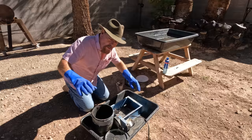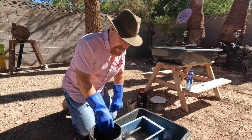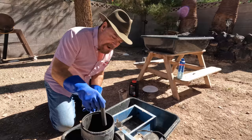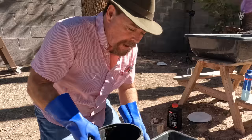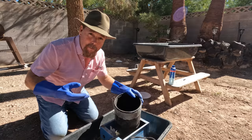Right now I'm going to show you how to set up that rod mill. What you're going to need is a rock tumbler — the biggest rock tumbler you can find, preferably made out of metal. I got a rubber one, and over time the rubber contracts and cracks, causing leaks and all kinds of problems. You're going to get yourself a whole bunch of steel rods and cut them just short of the depth of the drum. These are seven-inchers, and that's what's going to crush up your concentrates or gold ore into an even finer powder and help amalgamate that mercury.